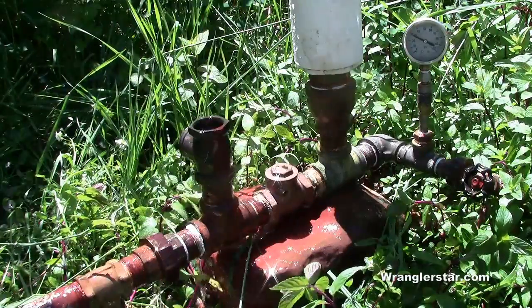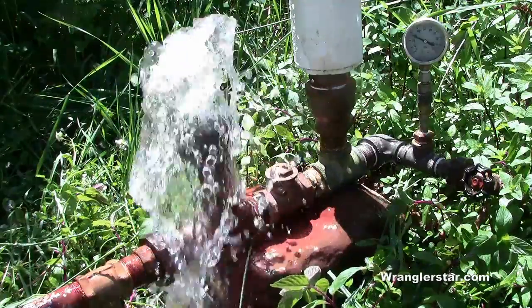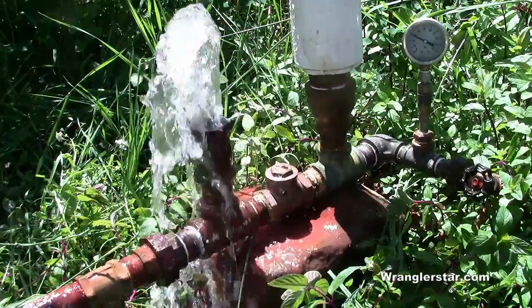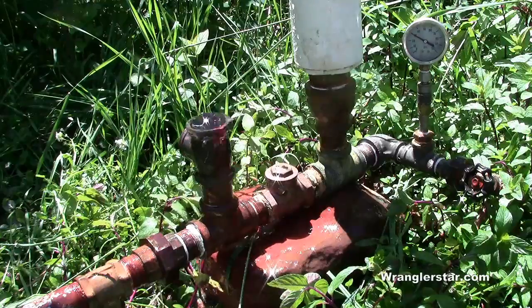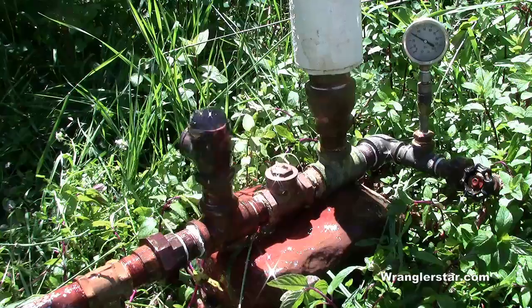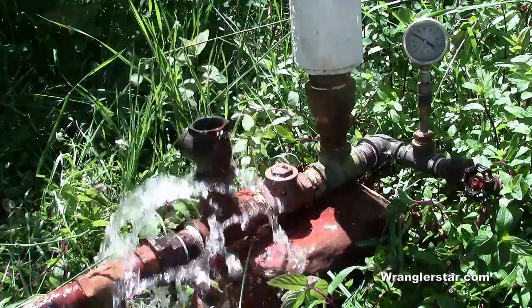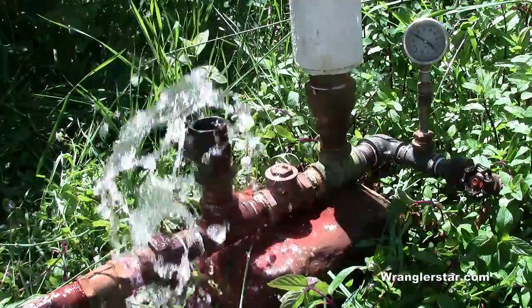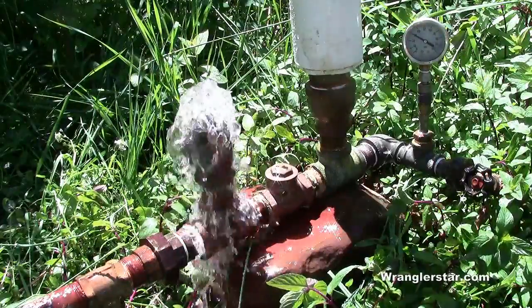From this little homemade pump, that will lift a lot — a long ways, a great deal of height. I'm lifting mine over probably close to 80 feet to the top of my water tower. Right there it looks like we're maxing out at right about 30 pounds of pressure. So that's just astounding — with 10 to 12 feet of gravity from the water source, this pump using no electricity, just kinetic energy, is maintaining 31 pounds now.